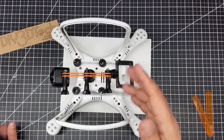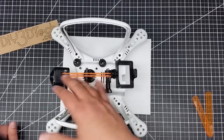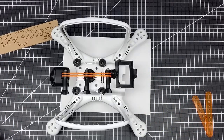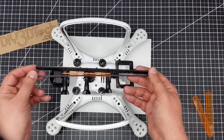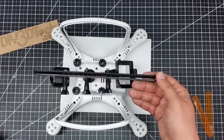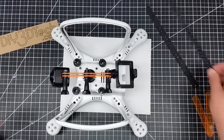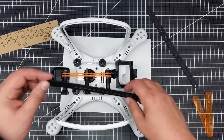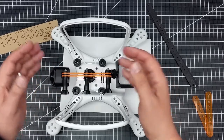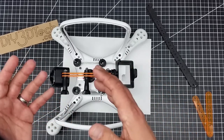Welcome to this edition of Videodrome by DIY3Dtech.com. In this episode, we're going to be revisiting this extended gimbal setup that I did in a prior episode, then we took it for a flight. One of the things I noticed with the longer extensions is I went back, I looked at the video — these cameras were getting caught in the prop wash from the downward, and that was causing that alternating oscillation that you saw. When I drove it a little bit differently, that oscillation went away.